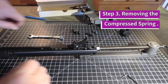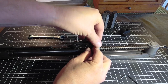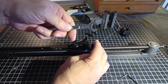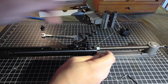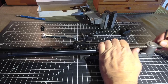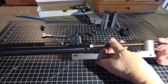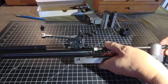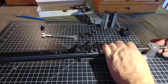We did get this pin out. There was a plastic piece that sits between the trigger unit and the stud that held the screw to the stock — slip that plastic piece off and that allows you to get a wrench on there. I used a 7/16 wrench to loosen and pull that out. That is the third point of retention for the end cap, which we now have loose. We can go ahead and start relaxing the tension, and as you can see the plastic end cap is starting to come out of the action.